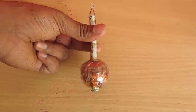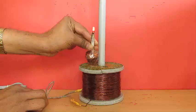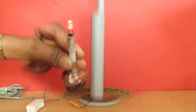Now we have a small coil with about 1000 turns and we have connected an LED to it. The moment we bring this coil close to the primary coil, the LED starts to glow because there is voltage induced in this coil.